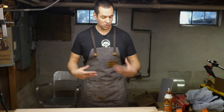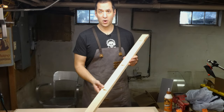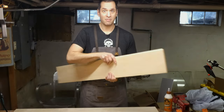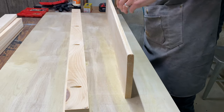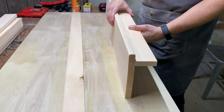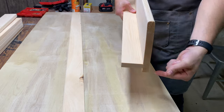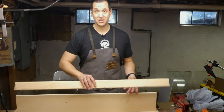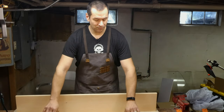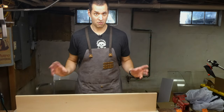Now that all the wood is sanded down, I'm ready to start gluing and screwing this all together. I'm going to use a combination of glue, one-and-a-quarter-inch pocket hole screws, and one-and-five-eighths-inch regular interior wood screws. The pocket holes go into the back connections, and the straight screws go through from the other side. Also worth pointing out: stock pine is going to have a little warp to it. I'm going to have to do a lot of pulling to get things straight, but between the glue and the pocket hole screws that should shore everything up.